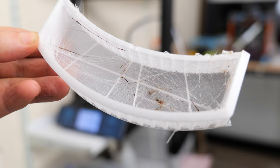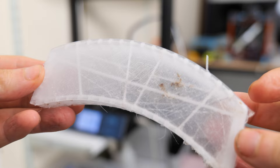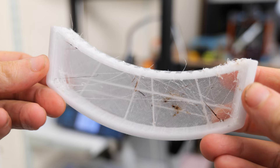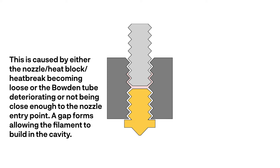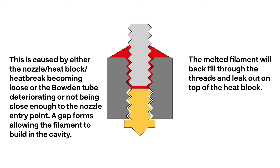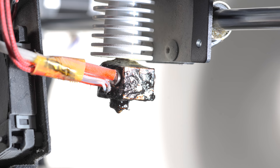For the last few months as I've been printing I've been noticing these burnt blobs that have appeared in my print. You can see one here - it's very evident when you are printing with transparent filament like I am. I initially thought this was just bits of filament getting caught up when the nozzle is moving, but from doing some research this is actually one of the common signs that your heat block, your heat break and your heat sink have basically come loose and the melted plastic is finding its way back up through the threads. That is exactly what is happening - the plastic is backfilling through the threads of my heat block out onto the top of the heat block and then oozing down and dropping onto my prints. If you take a look at my heat block you can see it's got this mound of plastic on the top where it's being pushed out of those threads.